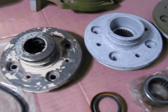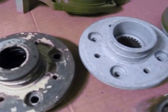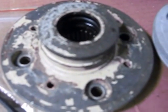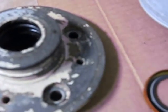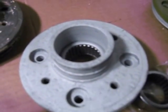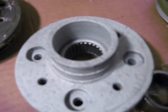The next item is the gear case head assembly. The OEM number is 0381849. Basically, on a lot of older units this has two seals inside. On the original one you get scoring on the shaft from these two seals. On the units we do here, we machine this out — this is a sample of one here — so that we can insert three oil seals instead of two.